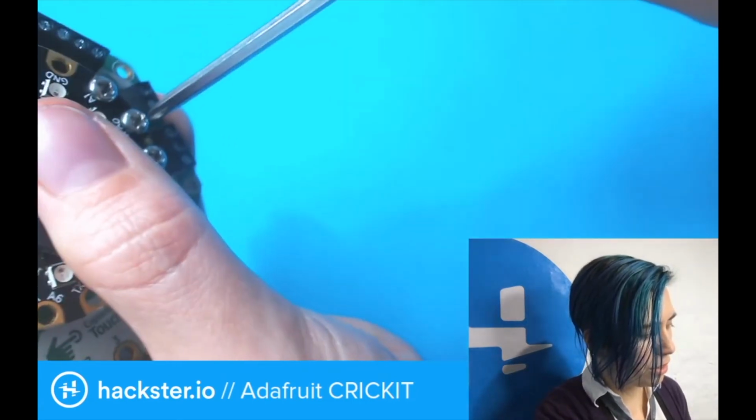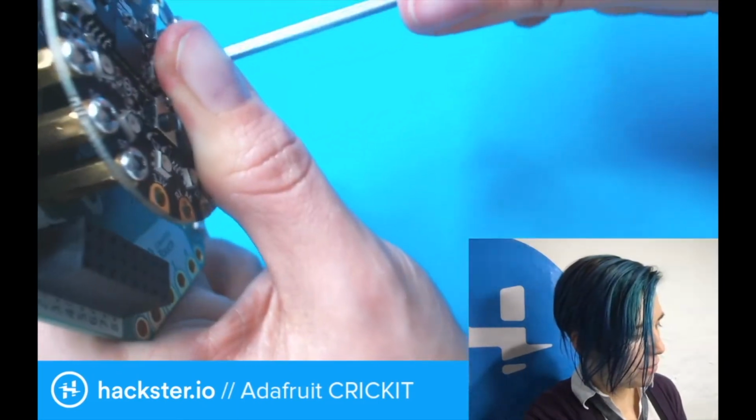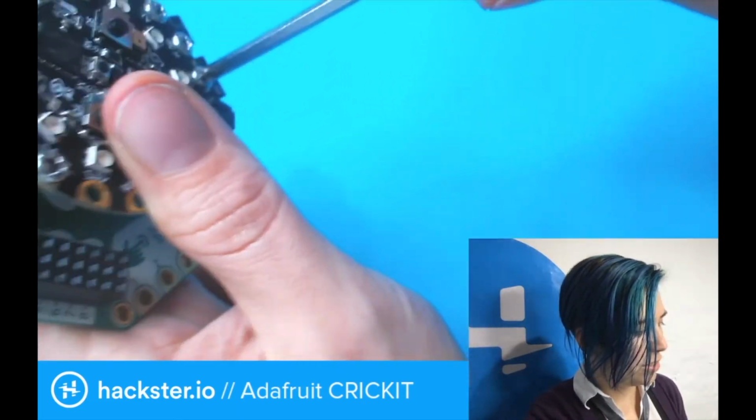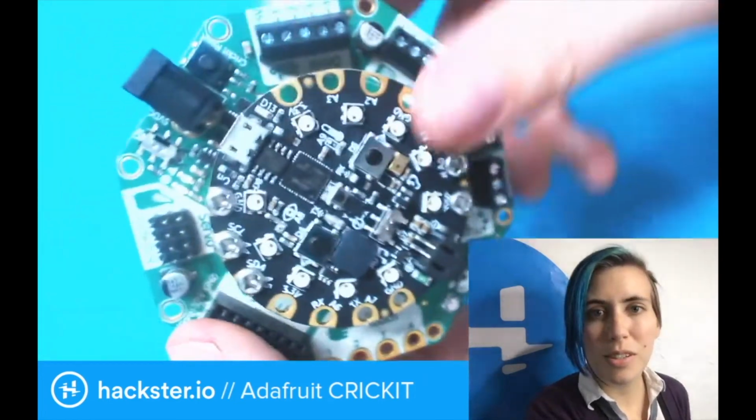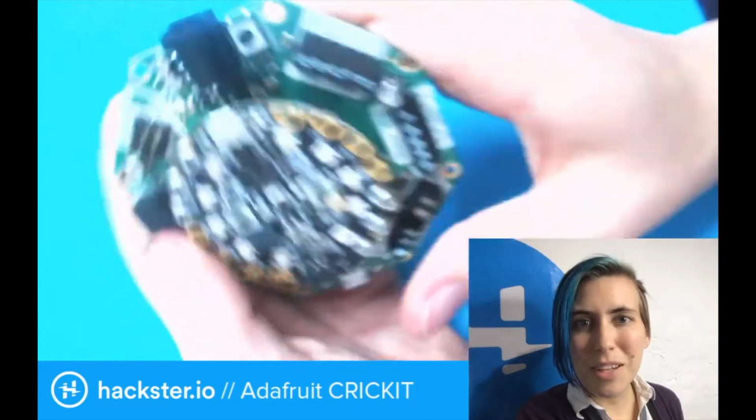I would definitely make a little hook shape out of the end of the wire and then tin it. But if you're going with solid core, it should be easier to form those hooks, but also there would maybe be more risk of breakage. Look at this. Solid little piece of equipment.